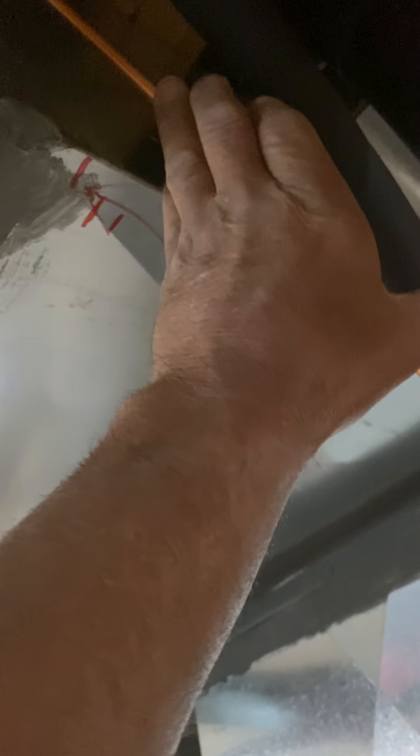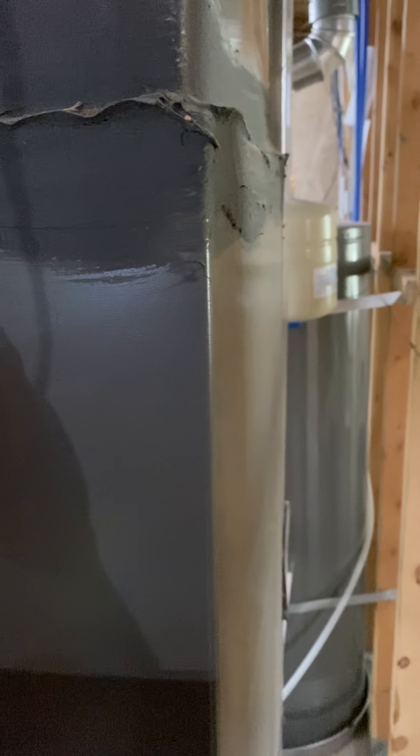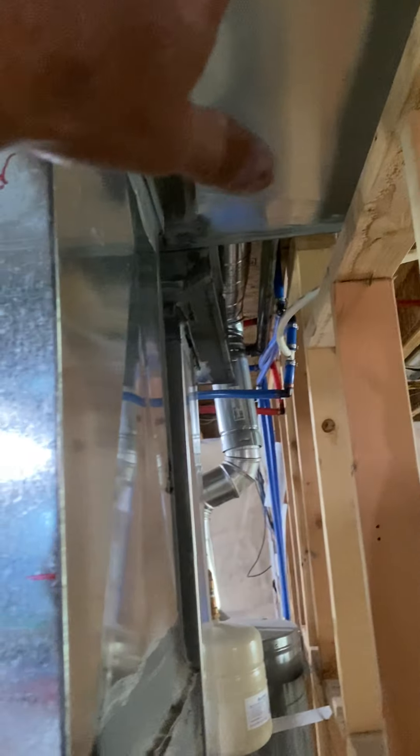The cut line is on the front here, and the damper will also go on the front. This one will come out the side, so adjust the line set as needed to get the motor out the side. This back one, the motor will come out the bottom. That way we'll move this furnace forward and be able to walk back here and have access to this damper.